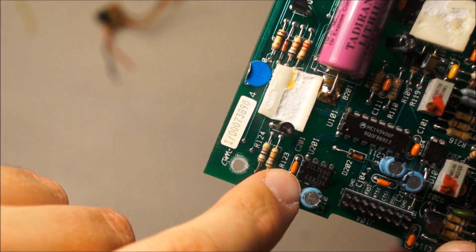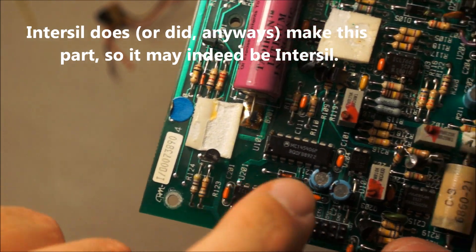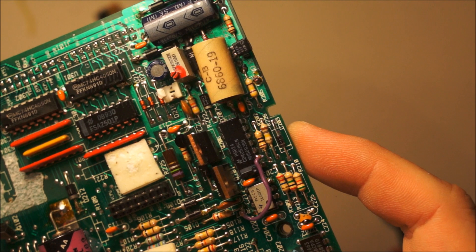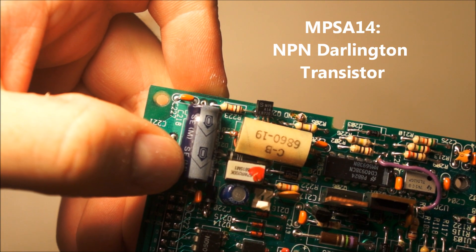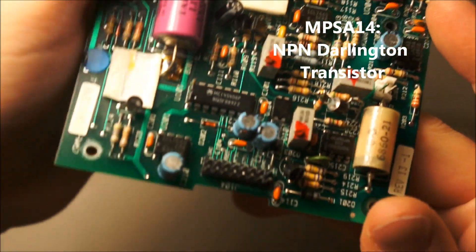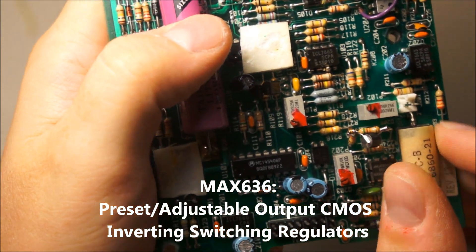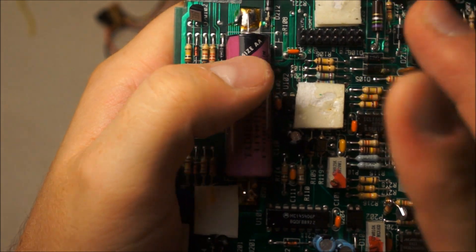Could that be like a really old Intersil part? I don't know how long Intersil's been around. But there's two of them, there's one here, one here. Oh, and there's a third. MPS A14E8720. And these are some really big chunky inductors. I wonder if they're some sort of funky little DC to DC. There's a Maxim MAX636ACPA — at least their logo hasn't changed recently. A couple precision resistors and a lot of just normal resistors.